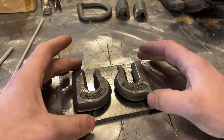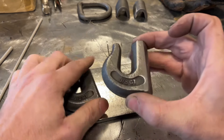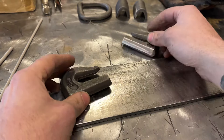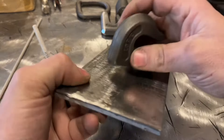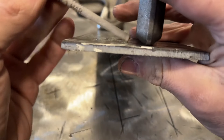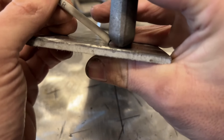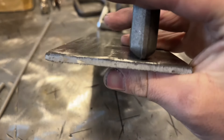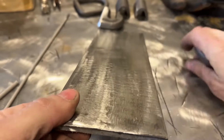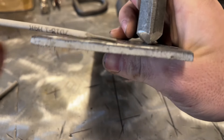The biggest thing you want to concern yourself with is proper prep. You don't want to just set this on something and weld it right on. You want to prep your material - I buffed the sides and the ends, and I also put a little bit more of a bevel on it. One reason is if you look here, this is an eighth inch rod. If you have the piece straight up without an additional bevel, you're not going to get the rod anywhere near where it should be.